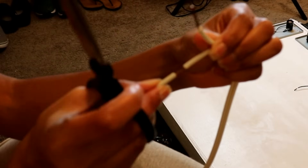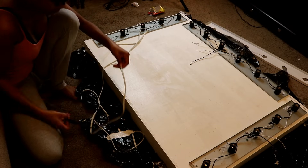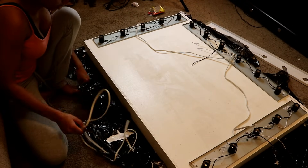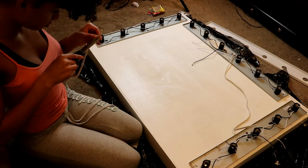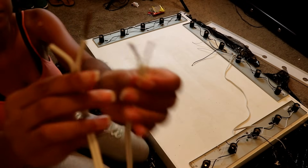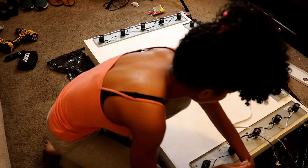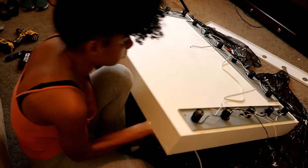Once you get through the rubber part, slide it off to expose the copper wires you'll use to connect to the copper wires inside the lighting bar. You'll have to connect each extension cord piece to each lighting bar, so make sure you get a long enough extension cord. Measure how long your cord needs to be to connect from one lighting bar to the next, then cut that length and expose two sets of copper wires on each end. You should have a total of three extension cord pieces. The longest one needs to keep the plug head attached — don't cut that off.